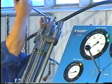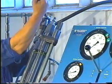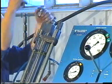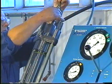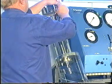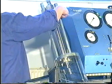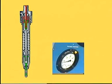Tighten the nuts until the top face of the pressure disc is flush with the top face of the spring housing. Connect the pressure testing pump and the return oil pipe to the fuel valve. Slowly fill the valve by pumping at low pressure until oil, without air bubbles, flows from the return oil pipe.